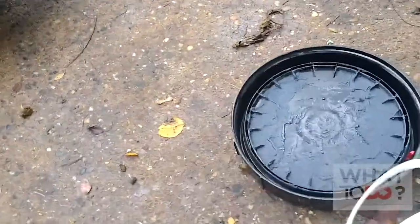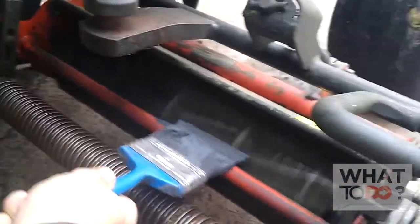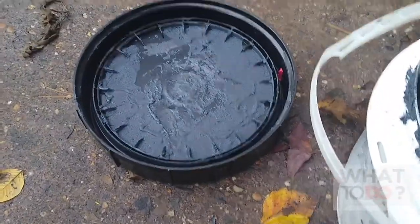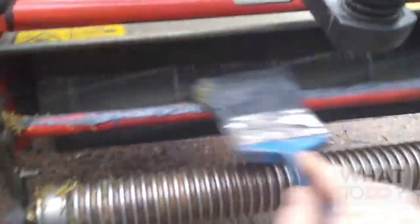You want to go around and hit all the reels, get them all back lapping at once. Be very careful because they're spinning at a much higher speed than your back lapping machine normally would, so you can adjust your throttle to get it to a comfortable speed. On this first reel here I was putting some compound on it, and you should hear some type of friction — but I'm getting nothing.